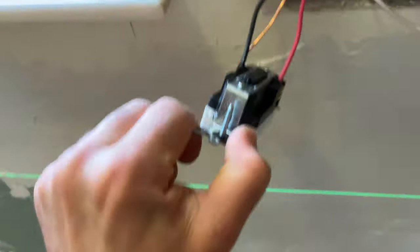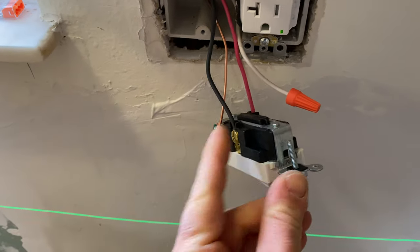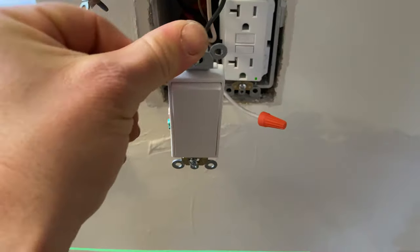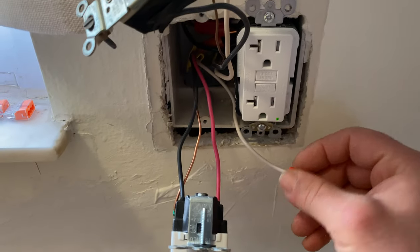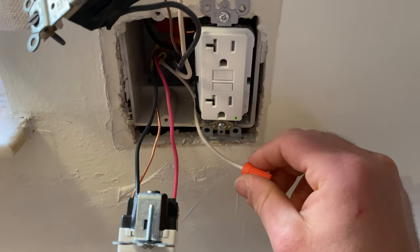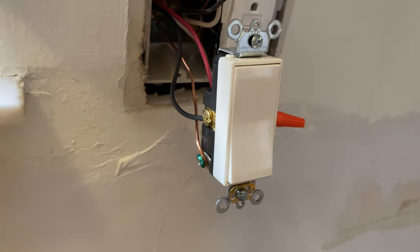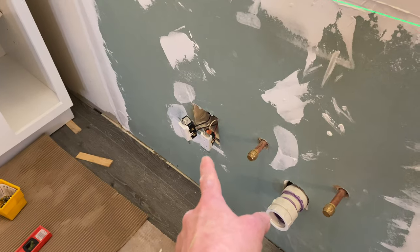On the other side of the switch: the switch hot line goes here, the real hot goes here, and the ground goes here. This is the 20-amp switch. Based on electrical codes, after 2007 the National Electrical Code requires a neutral at the switch, but you're not connecting it to anything — just tape it off and put it back. When connected this way, it works perfectly and the GFCI protection works for both outlets.